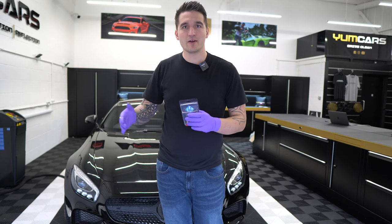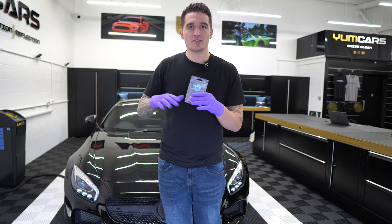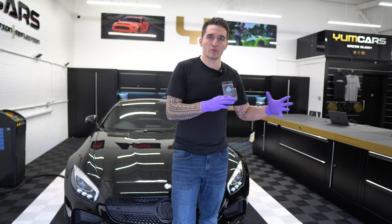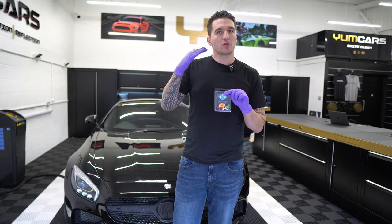So in the description, you will see that 3.0 is designed for certain pressure washers, and the 4.0 is designed for others. We'll give you a list of the most famous pressure washers, the Karchers and Nilfisks, and we'll tell you that a certain nozzle pack is designed for a certain output flow of pressure washer. So just make sure you choose the right orifices.